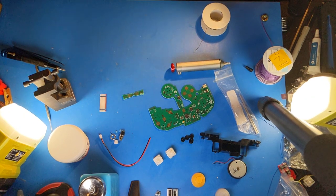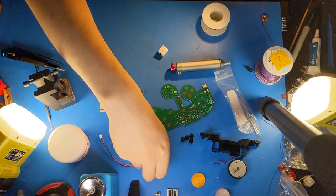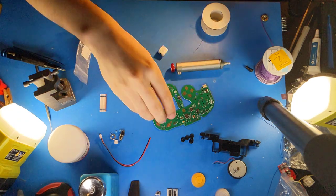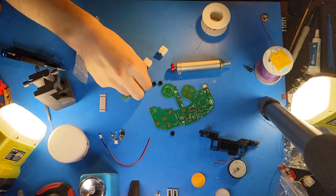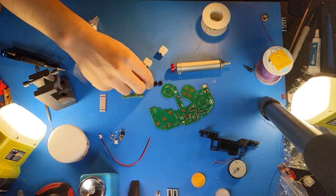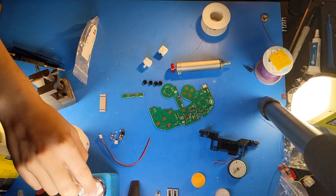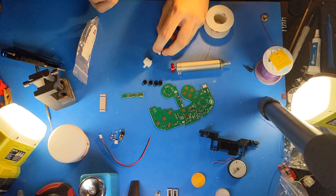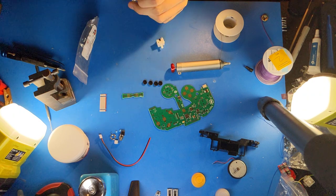And the next step is to do prep work on the stick boxes. So the stick boxes have pegs that we need to mount magnets to, and I'll be using these 3D printed magnet holders. You can get the designs for the magnet holders either printed by JLC. Those files are on the GitHub, or you can find adjustable designs for FDM printing that you can get on the PhobGCC GitHub in the 3D printing channel.